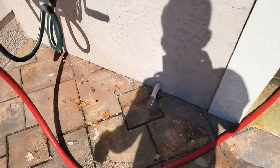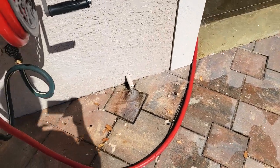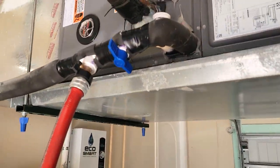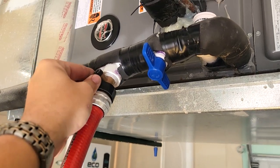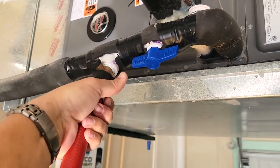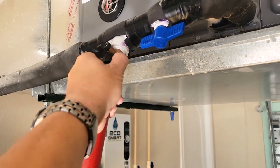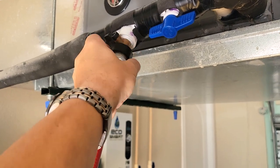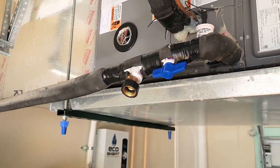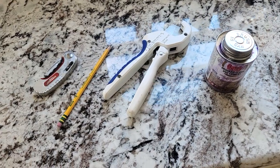Now I'm going to show you what to do to turn it off — I'm going to turn the hose off. Now to put it back into regular mode, we turn the hose connection off, turn the drain line valve back on. And there we are — drain line is clear, the unit is back to normal functionality.